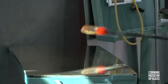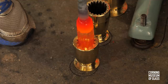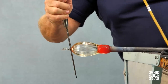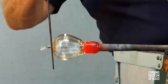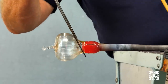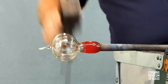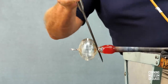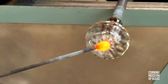After a substantial reheat, the cup is lowered into the optic or dip mold and blown hard. The end is pushed inward, resulting in not a spherical shape, but rather the shape of an oblate spheroid. A constriction is made near the blowpipe, the excess glass knocked free, and a merese is formed.